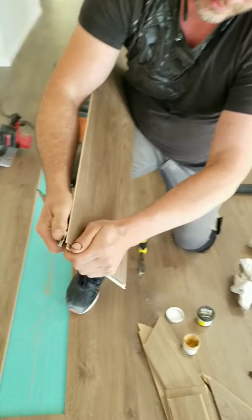I'd recommend not doing this repair in the middle of a high-traffic area for your first time — try it in a closet first, so if you fail nobody will judge you. If you're already experienced, hopefully you can get some quality tips here. My board is prepared. Now I'm going to check if it fits the space. Sometimes a new board won't fit — it may be drier and the existing floor has absorbed moisture, so it can be tighter or slightly off.